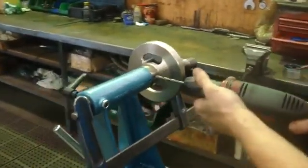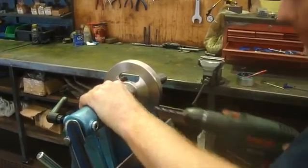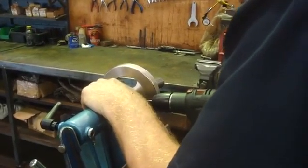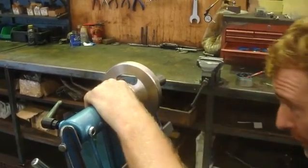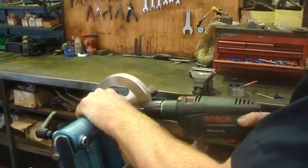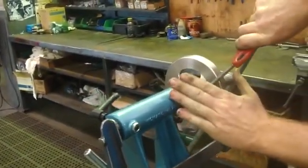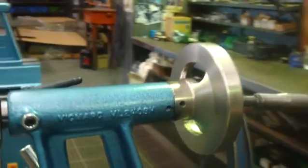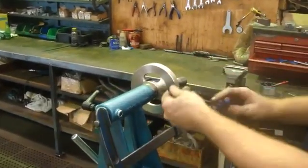It's holding everything in position, so you can drill the other two. Just be careful and make sure you don't wander up, because you're going to damage the threads. You just want to start it nice and easily, nice and slowly. I've got two really nice little holes — two nice little marks which are just a perfect circle, so that the tip of the grub screw is going to locate in there and nothing's going to move either way.